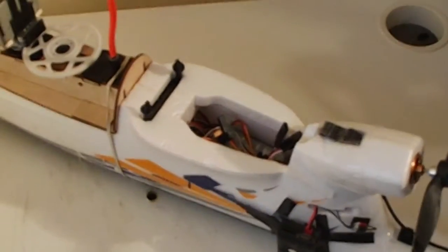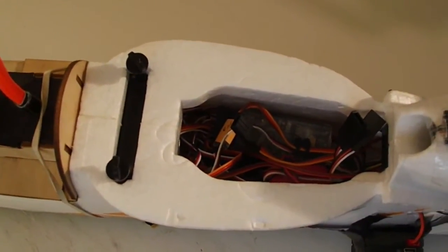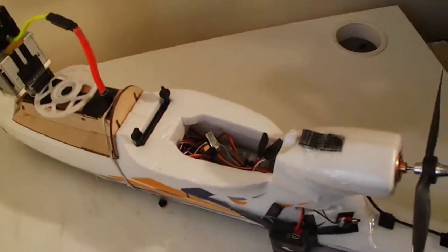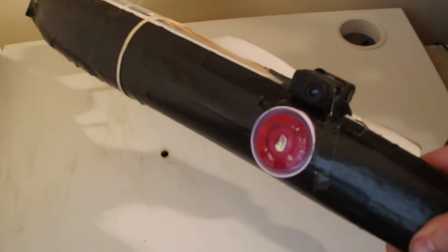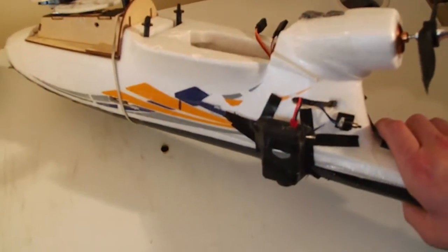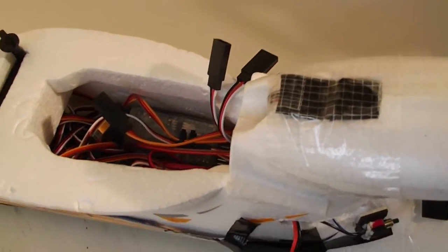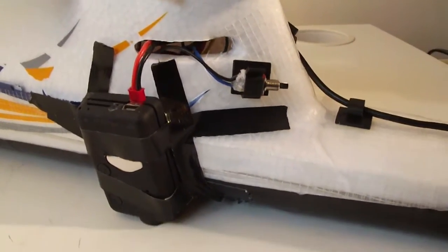Next, inside we've got all the controls and things like that. So, quickly disconnect the camera. In here we have the Dragon Link receiver buried. I also have my FlyDream OSD installed in there, and if I turn the plane upside down, one sneaky feature I've not mentioned yet is a 120 decibel siren just stuck in the bottom, because why not? It's quite fun to be able to interact with people on the ground. I've got a Mobius down-facing camera, which has 5 volts supplied into it, so don't worry about the battery going flat. On top here I have the GPS for my OSD mounted, and then the set home button just comes out here. Obviously I set that every time before I fly.